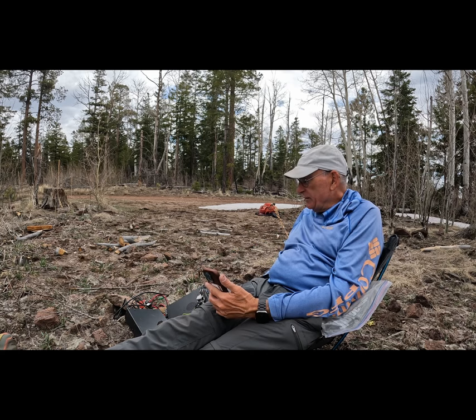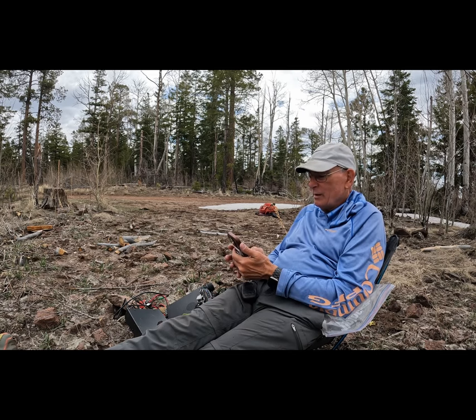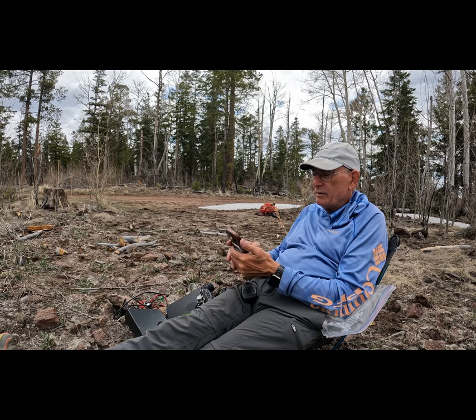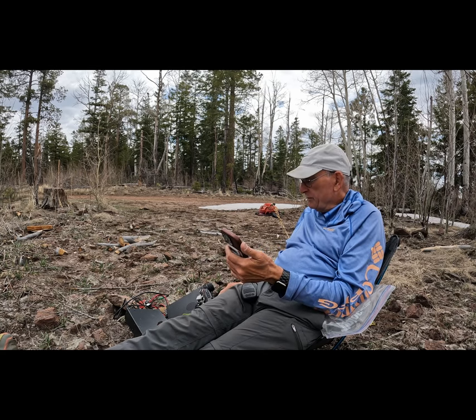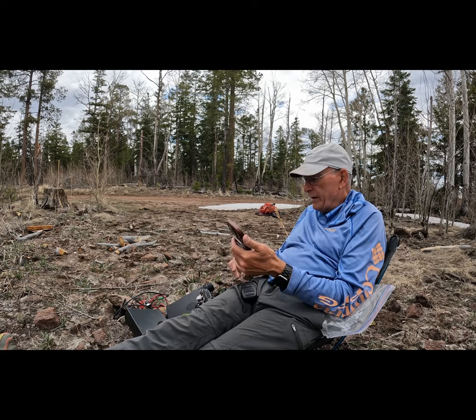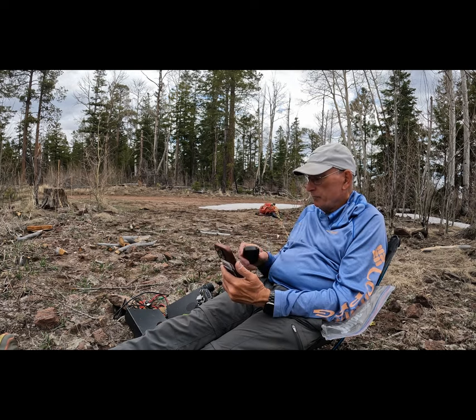And we'll use the coarse tuning knob to get to 21.300, here we go, 21.300, that'll put us squarely in the sideband for 15 meter. Let's hit the tune button, tunes right up, flat SWR.